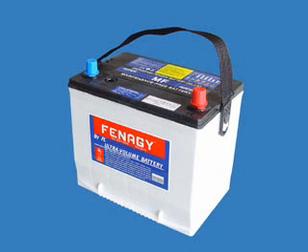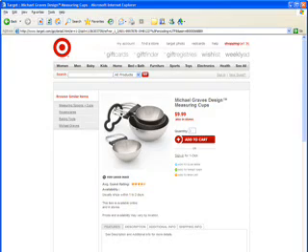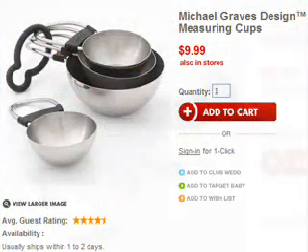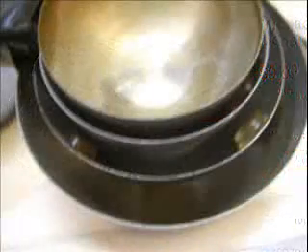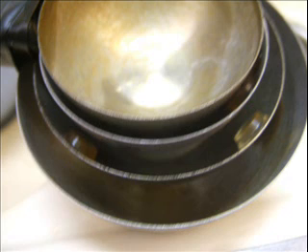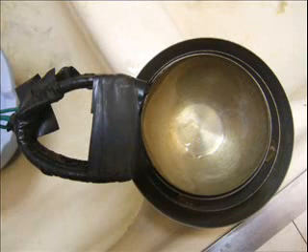A motorcycle or car battery will work nicely. For the electrodes, I wanted to use stainless steel, and the lowest cost item I could find was stainless steel measuring cups that only cost about $10 at Target. I used little rubber feet to assure that the measuring cups would not touch and short out the battery charger, and to help maintain a constant distance between the cups. I added wires and used electrical tape to isolate the handles on the measuring cups and hold the cups firmly together.